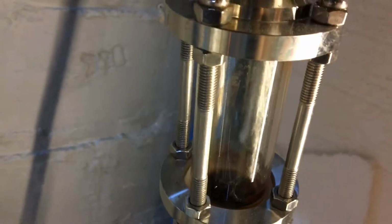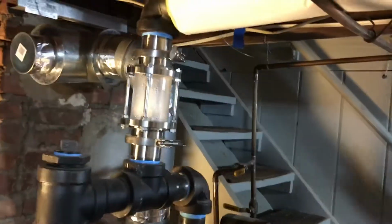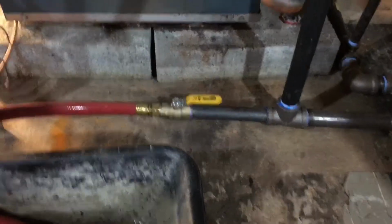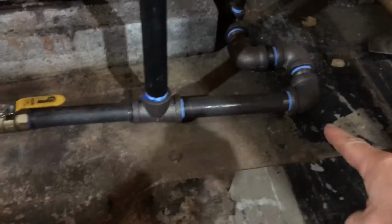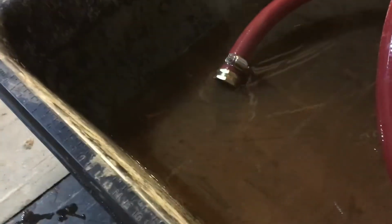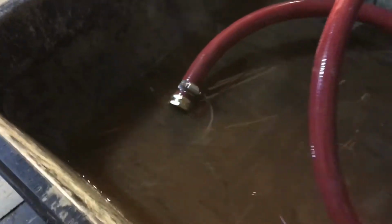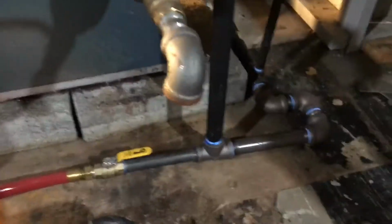If the boiler's running, this much water is leaving the boiler chamber via steam and is condensing up in the system and then returning as condensate water. But it doesn't return into the boiler when there's a leak. It returns into the wet return and then it goes out the leak. So that's where the failure of the Hartford Loop is. It's supposed to protect against this kind of problem, right? That's its job.